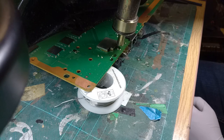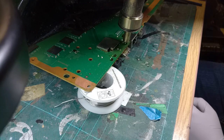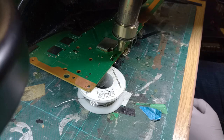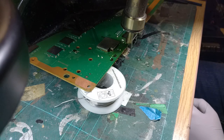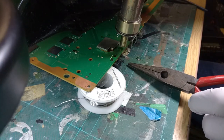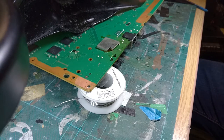We've just got to work back and forth across the port. The first thing you need to do is just loosen the ground pins because this port's got to come out. But it's not particularly well soldered in, so it shouldn't take much to drop out the other side either. It's already starting to move out, front end first. We are out one side completely now. There's a lot of crap coming off this stuff - it's horrible. Remember boys and girls, that lead free is good for the environment, just not your lungs. It looks to be out - what a bloody horrible thing that was.